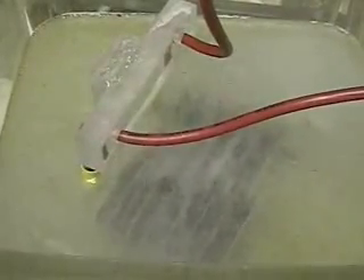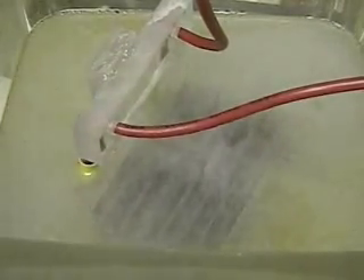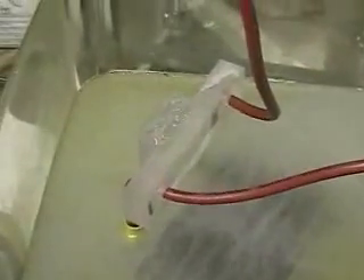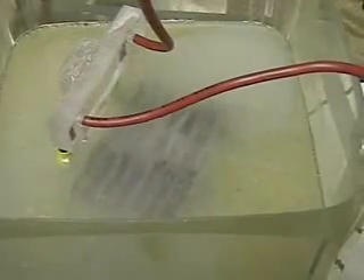Between the last video and this video, you could see the garbage in the last video and the amount of hydrogen that came out of the cell using tap water. The reason I'm showing you this long video is because the cell is not operating correctly — it should be putting out more hydrogen than it is. We're putting out more than 13 volts at almost 10 amps.